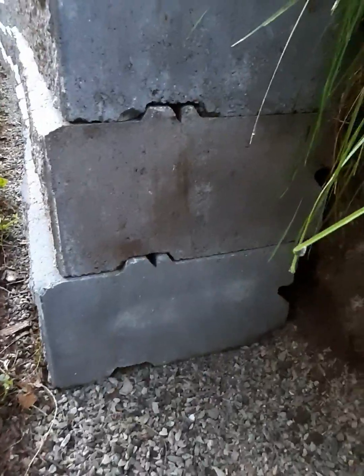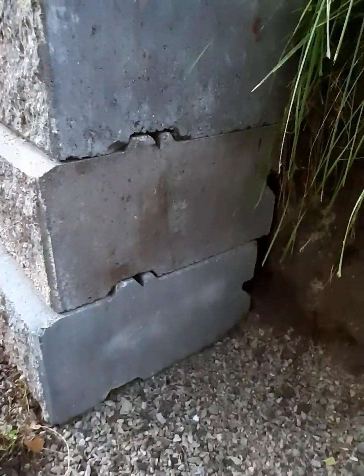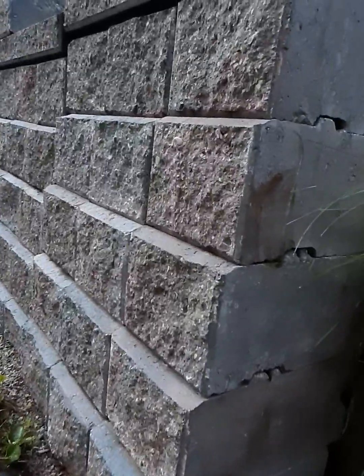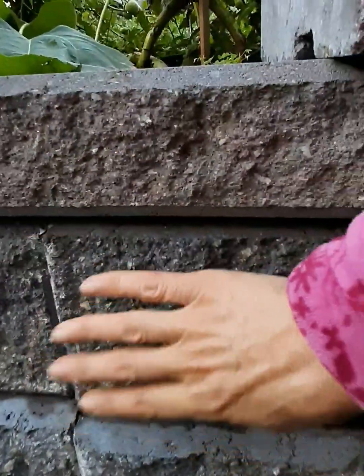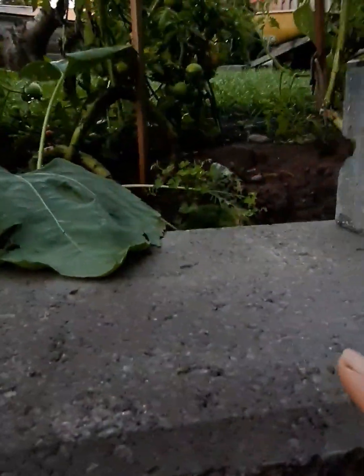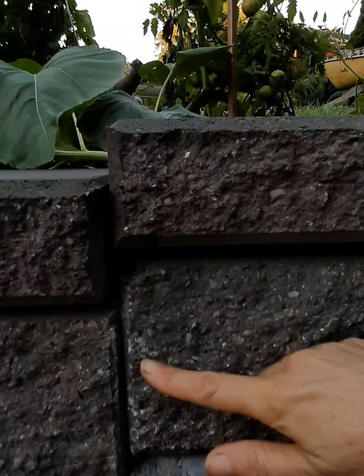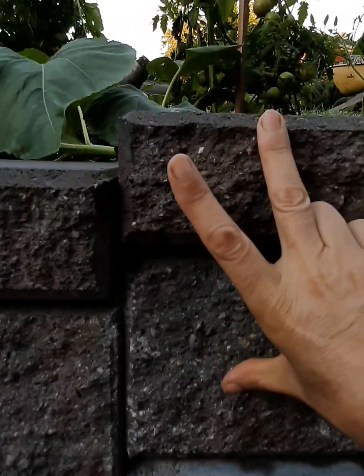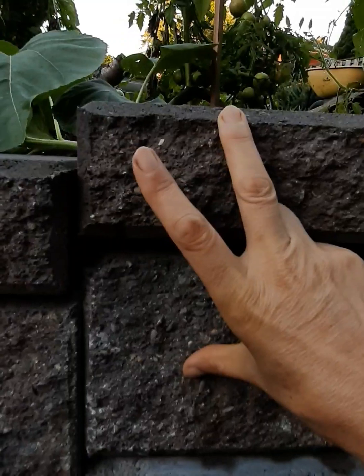Setting the first course is the most difficult part when it comes to a wall. But with the stair, it's much easier than the retaining wall I built here, because you're basically building a retaining wall that contains only the top part. So you only have from here to here 1 riser and 1 coping. You have to make sure at all times that the distance from the top to the bottom of the stair is about 6 to 7 inches. You have to find what you prefer.